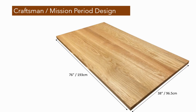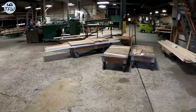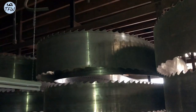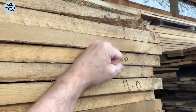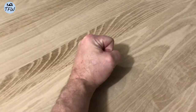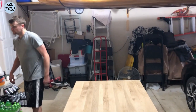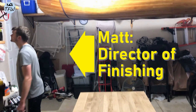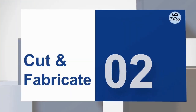The tabletop will be 76 inches long and 38 inches wide, and my tools simply aren't good enough to get a perfectly flat tabletop at 38 inches wide. I always love visiting my hardwood supplier where the tools are amazing, including these massive bandsaw blades. Today the mission was to go through the white oak lumber pile and pick out some winners, and through the magic of video editing, they did the glue-up for me. Because they have commercial equipment that can do surface planing this wide, the top is perfectly flat and perfectly smooth. Eventually this is going to get handed off to my son Matt, as a little commemoration of our 2020 canoe project. Now it's on to some cutting.